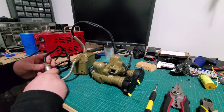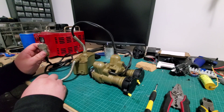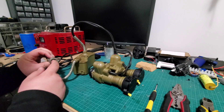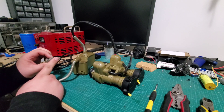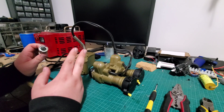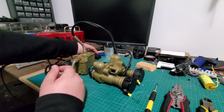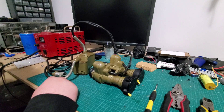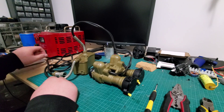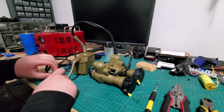If you don't have access to a power source, your PNV57E should come with an adapter that plugs into this. So you can plug that adapter in, cut the wire on the adapter, and then it's just a positive and negative wire. You can wire the 9-volt battery holder into the adapter wire instead of cutting the power cable and potentially not being able to figure out which wire goes to what. The only downside is you'll have all this extra cable, but that's another way to do it.